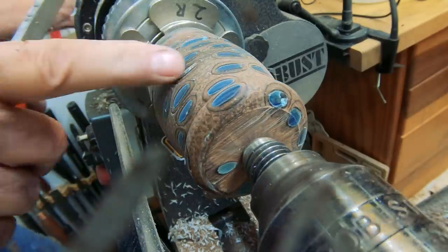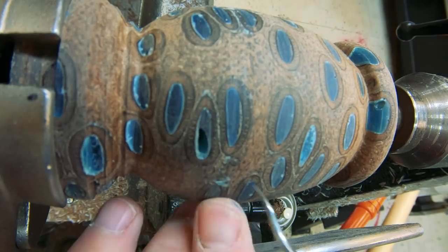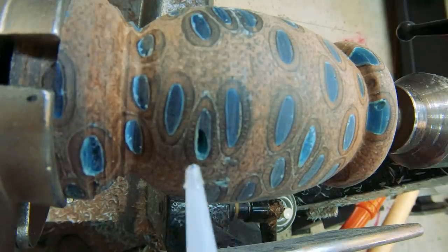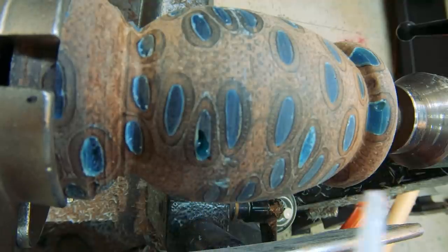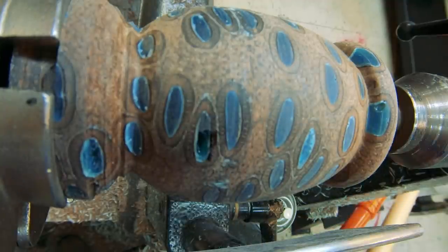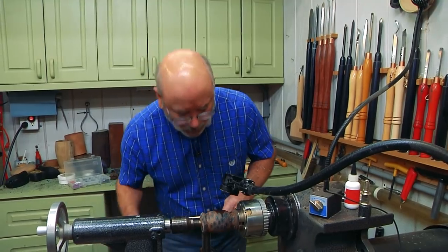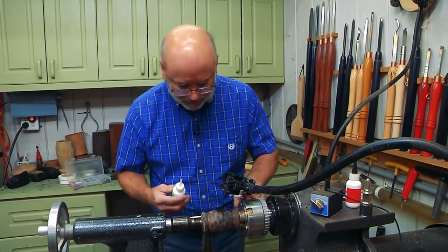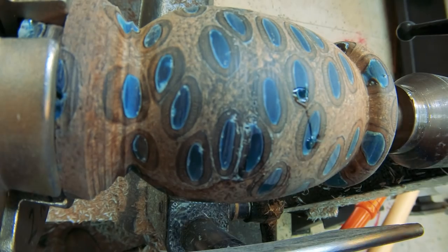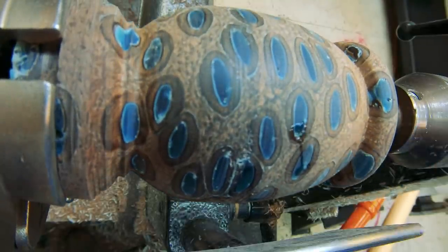Now we have to do a little bit of housekeeping. Here's an example — there's a bubble and it's not filled up. That'll look kind of ugly in the end. I'm going to take some cyanoacrylate gap-filling glue and put a little bit in there. One thing to be careful about: don't fill it all the way up — I did that once and the outside dried but the inside did not. I'll use a dental pick to work it in, then take some accelerator to speed up the drying process. Then fill the level back up, get it level, and do that a couple times. You don't want to use too much because it'll be sticking proud and hard to clean up.